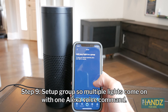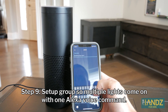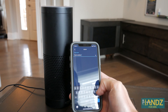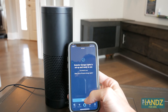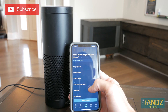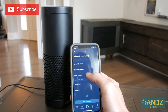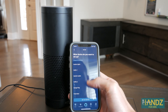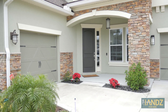We could set up a group if we want. Add your lights to a custom group — let's call it 'front outdoor lights.' Done, continue. We can go back and click front porch lights, set up device, choose group, and add it to the front outdoor lights group. So they're all ready to use, and now I can just say, 'Alexa, turn on the front outdoor lights.'